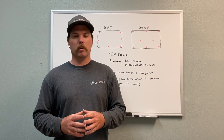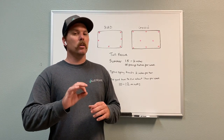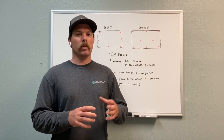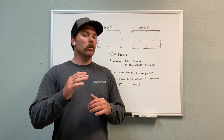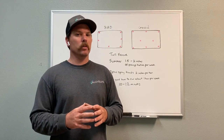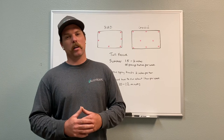If you have any further questions we're more than happy to help. Keep in mind that new low-precipitation heads like the MP rotator or the Rainbird rotator nozzle water much, much slower — they're closer to 0.4 to 0.5 inches per hour — so you will have to water quite a bit longer with those. But that's a good thing because you get the water deeper into the soil. Thanks for watching, and I hope this video has helped you today.